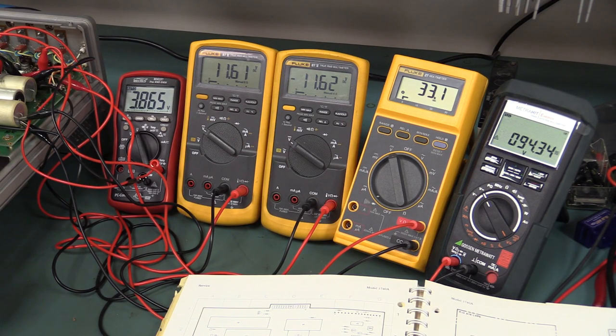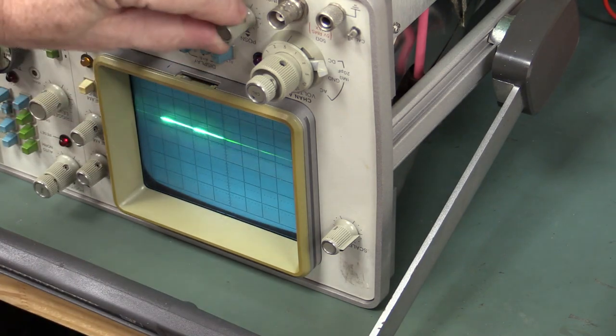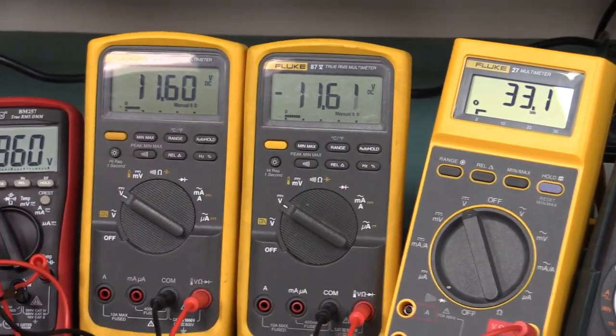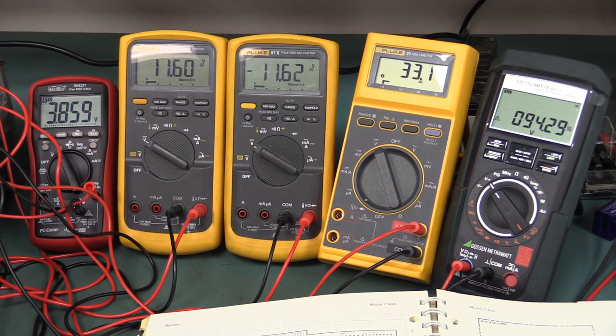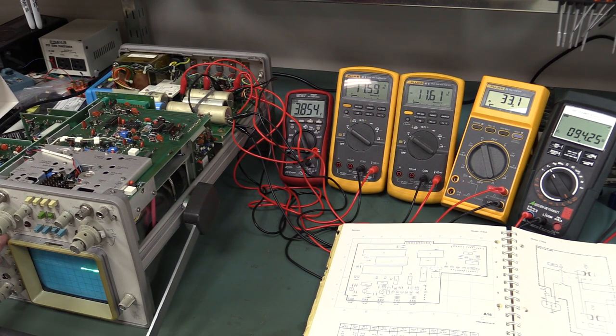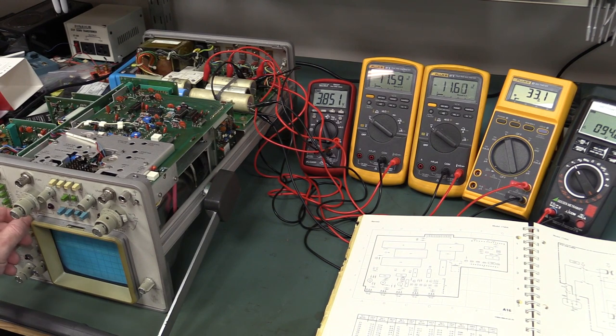We got one! I just disconnected the mains power cord out the back and then reconnected it — bingo! Look on the screen: just that fixed line, and all the rails are low. Okay, these aren't in min-max anymore. I'm going to wiggle that mains cord and see what the problem is. Wiggling the mains input connector — no, that's not it. Let me wiggle the front panel line switch and give that a bit of a jiggle — nothing doing there.